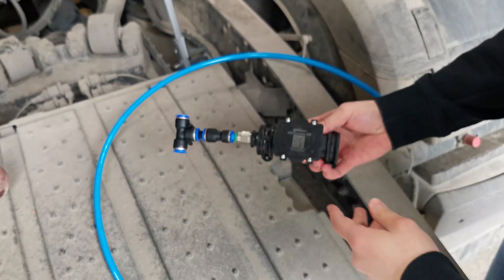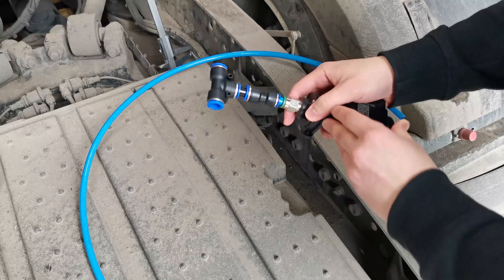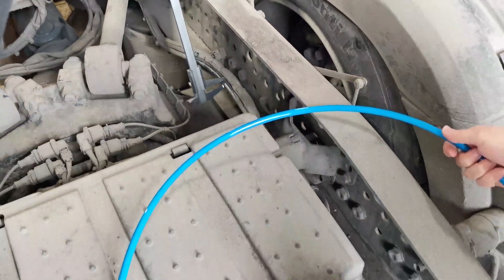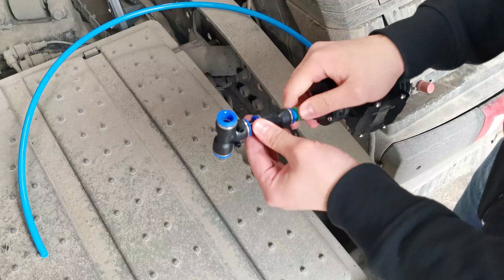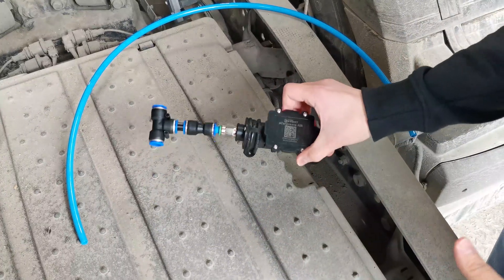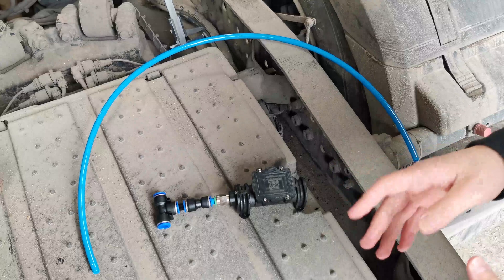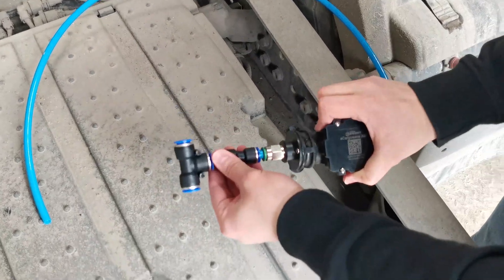Before installing the sensor into the air suspension system, you have to make sure that the tubes of the sensor and its socket coincide in diameter with the tubes that connect the bellows. If they do not, you will need a fitting to serve as a connector. It would be a great idea to ask your end customer to take measurements of the tubes before the truck arrives, so you come prepared and do the shopping before going to the installation site.